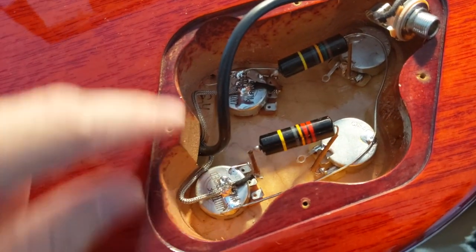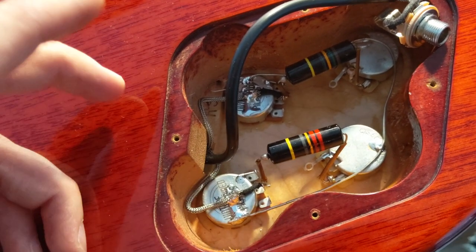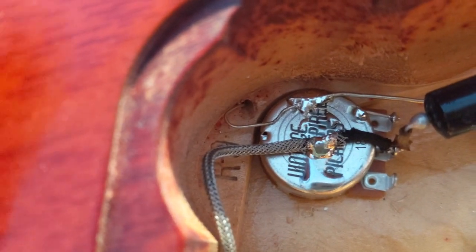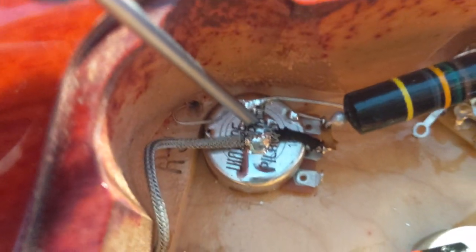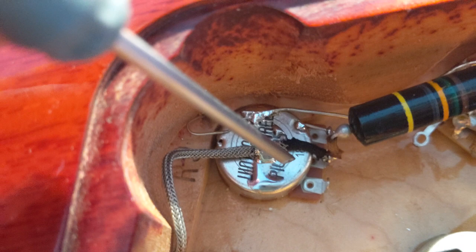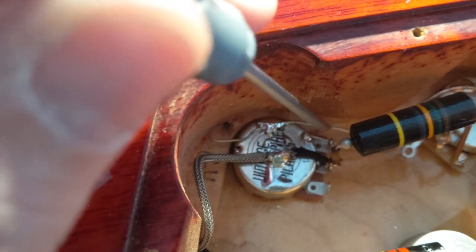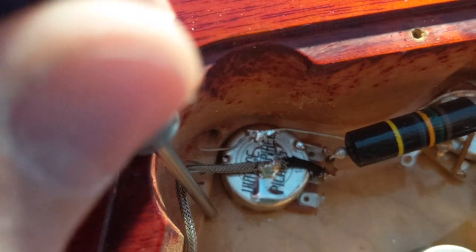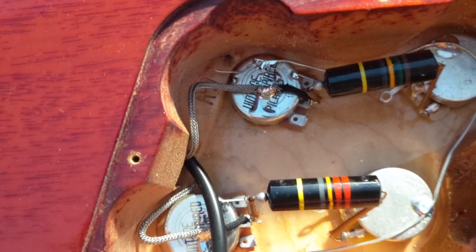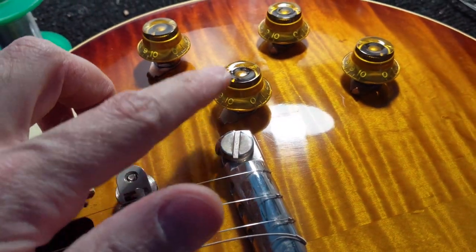The new pots are in. The writing on them means you can't solder directly to the printed area, so you kind of have to glob solder over it — but it sticks fine to the portions that don't have printing. You can see where the solder took versus where it didn't on the writing. I was globbing it to have a place for the switch connection. You also have to use leads for the ground connection because that terminal won't bend back like a CTS-style or old-school Central Lab pot. All in all, it's an experiment — we'll see how they sound.